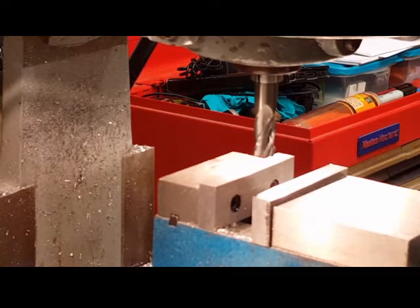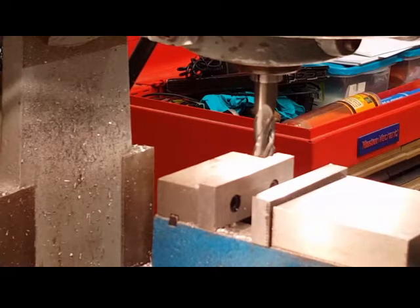And looking at my measurements, from the top of the hole to the top of the radius is 320 thousandths, plus basically 200 because the hole's 197 thousandths. So 320, 420, 520 down from the top. And we'll go ahead and mark it. I'm just going to use a Sharpie and some calipers here real quick, just to give me a couple of sight lines of where not to cut, where I don't really want to cut.